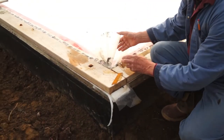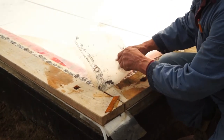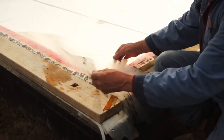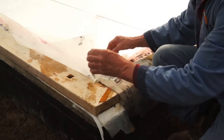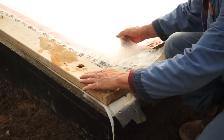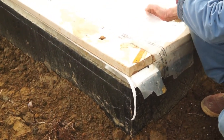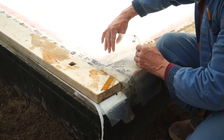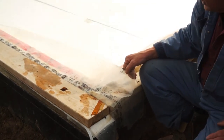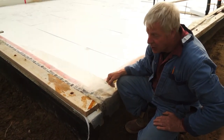Those two sheets — one of the sheets will go below the concrete slab in this home, and the other will be the vapor barrier that will be on the interior of a double stud wall. Basically, we want to create a complete barrier for air flow to and from the outside of this home.